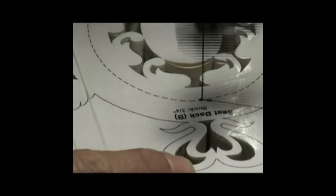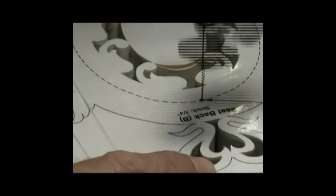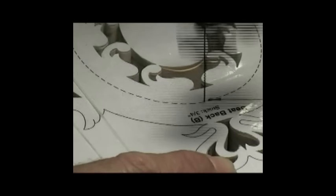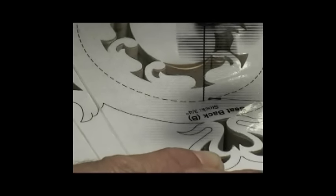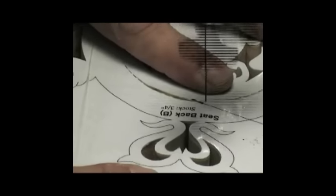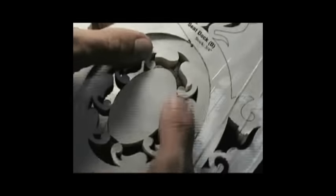Keep the following in mind when you're making bevel cuts. The larger the blade and the lower the angle, the more the item is going to protrude. The smaller the blade and the larger the angle, you got it, the less it will protrude. I recommend practicing on scrap prior to actual cuts on work pieces. Once we finish the cut, we'll make the exterior cut, and then later after sanding, we'll lightly router the back of the bevel pop-out and the front of the perimeter hole with a Dremel router attachment.